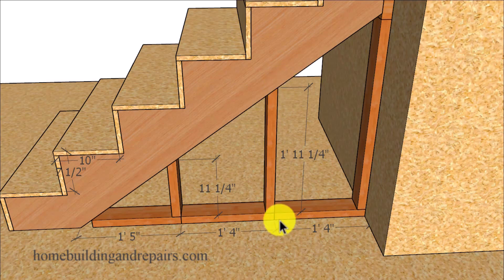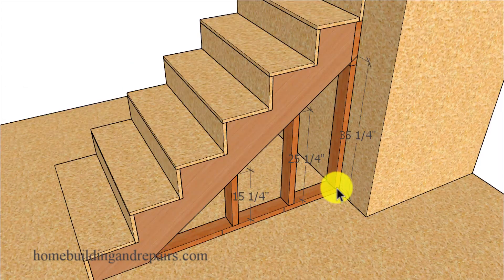I level up, make a mark, and then measure each individual stud. But that really isn't necessary. We could simply subtract 10 inches, 11 inches, or 12 inches off of the tallest angled stud under our stairway.